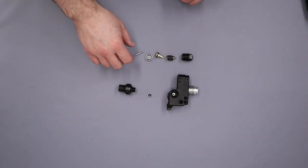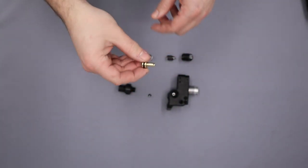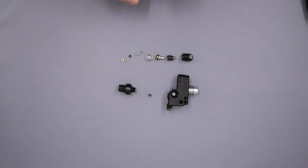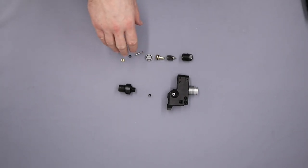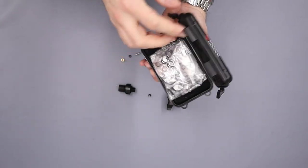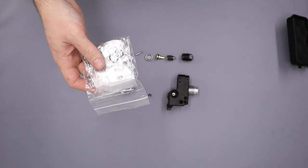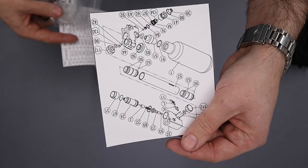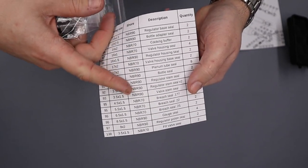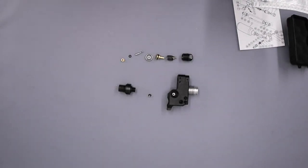The next thing is that I've gone ahead and replaced all the o-rings on the individual components off camera, just to save us a little bit of extra time. You can find all the o-ring sizes online on the Air Max website under downloads, where you'll find the exploded diagram of the rifle and all the individual o-ring sizes. I've made up a little o-ring kit with all the o-rings individually bagged and labelled, along with a sheet containing the size, shore, and a small description. That's going to be on my eBay store — I'll leave a link in the description below.